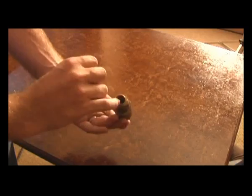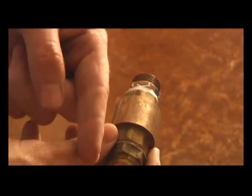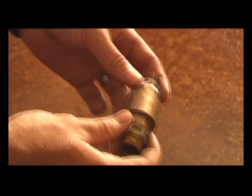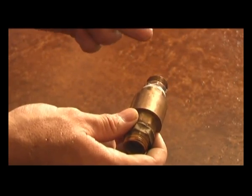This is a non-return valve, a spring type. It allows water to go in one direction but stops the water from going back. This helps with the pump system — it stops the water at night from coming back and cooling off the tank. It also keeps the pump primed when the mains has been switched off.